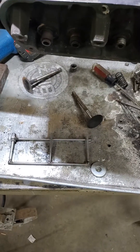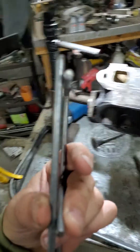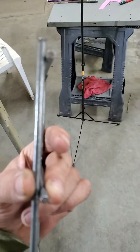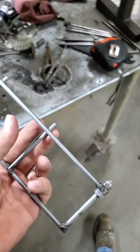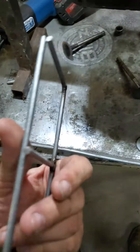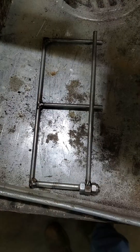Something I've always wanted and always put off because I didn't quite understand it — but now that I understand it, it's actually really simple. To calibrate it, all you need to do is make sure both tips are touching at the same time with nothing in it. If those are at zero when closed, and your center point is half the overall distance, it should work. This is roughly seven and a half by three and a half inches, but dimensions aren't super critical — I kind of slapped it together and it took maybe 15 minutes to make. I cut a bolt off down here so I could double-nut it with a lock nut to put just a little pressure on it, and there's no slop in it. I think it's going to work really slick — hopefully this helps.